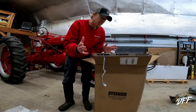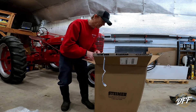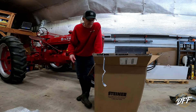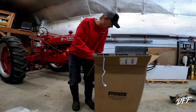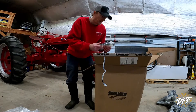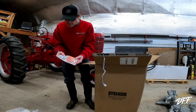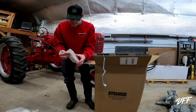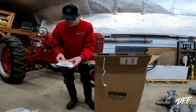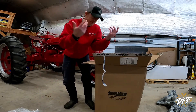I ordered light bulbs even though it seems funny. The tractor is 6-volt and I'm leaving it 6-volt, so there are 6-volt light bulbs. I bought some just to have as spares. And if you remember from a previous video, the rear work light was not working, and I'm hoping it's just the bulb. We've also got plug wires. This was a little kit they had — it has spark plugs, a rotor for the distributor, and some other items. Just a tune-up kit they put together.